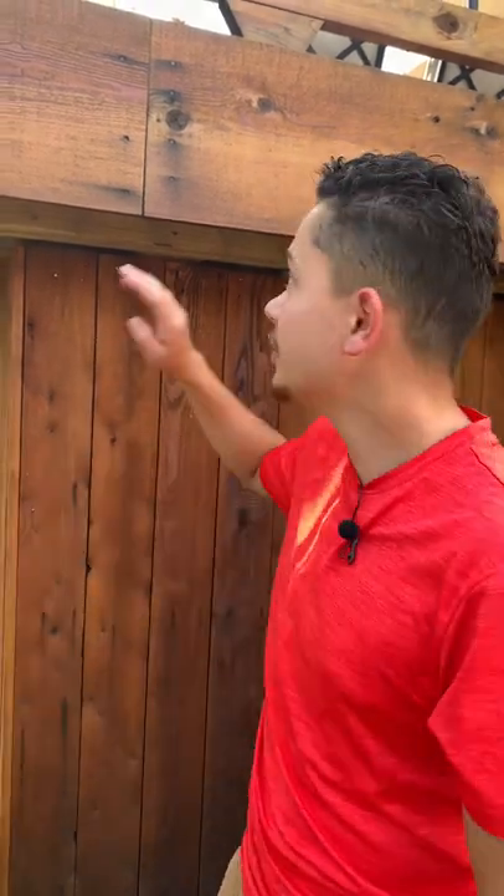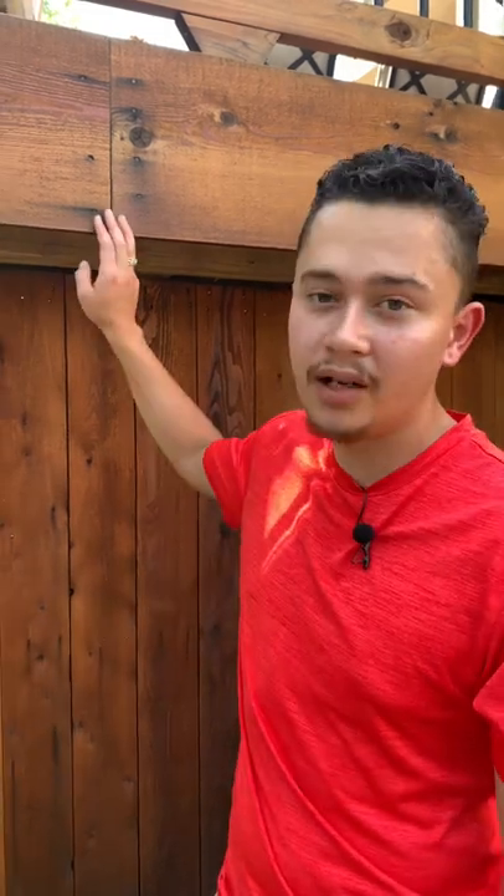We see this sometimes when clear stains or clear sealers are put onto the deck. If you want to protect your deck, I stay away from sealers — I always tell everybody to stay away from sealers because they only last about a year. But with this true stain finish, you're looking at two to three years, and what happens is it just starts to fade.